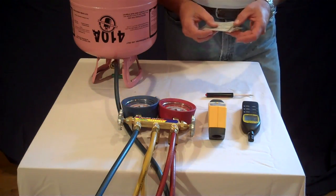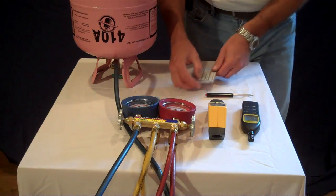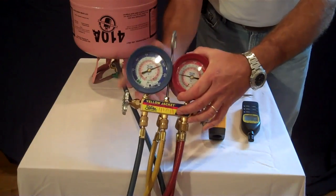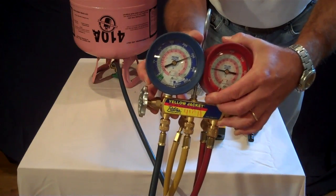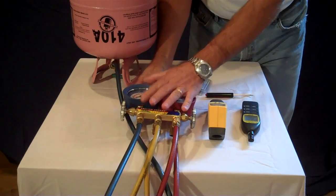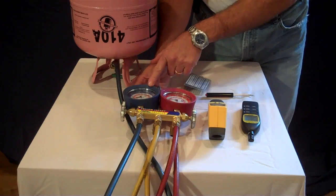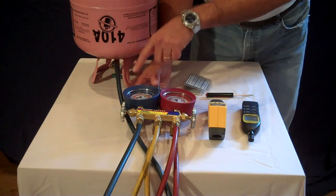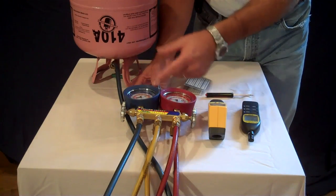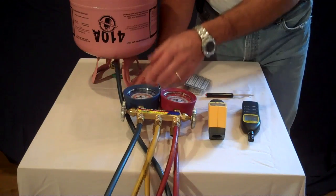Since it's slightly higher than 83 degrees, the pressure is somewhere between 245 and 255 PSIG. Looking at my gauge set, my gauge is actually reading 250 PSIG — so my gauge is correct. Now, if my needle were below 250, say around 235, I would take my adjusting screw and turn it clockwise to raise my needle. And vice versa — if it were too high, I'd turn my adjusting screw counter-clockwise to lower my needle.